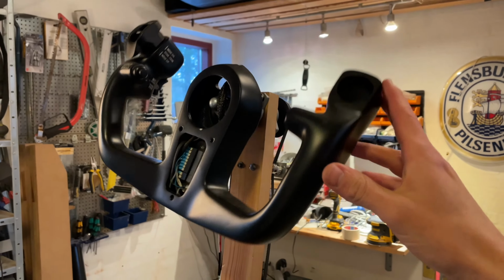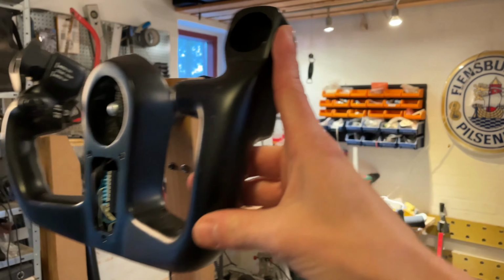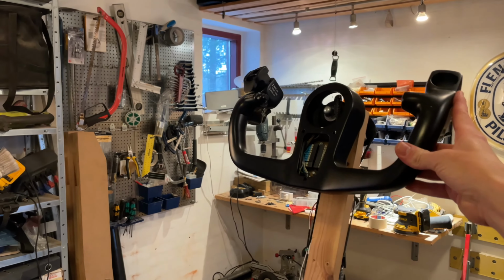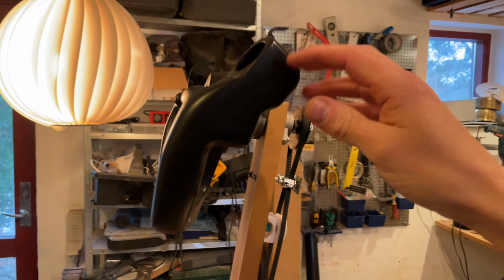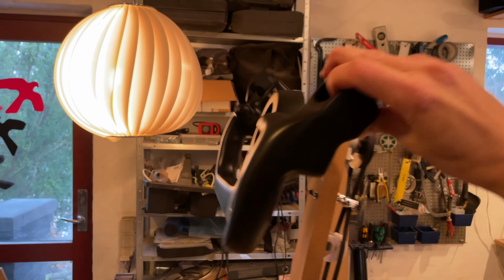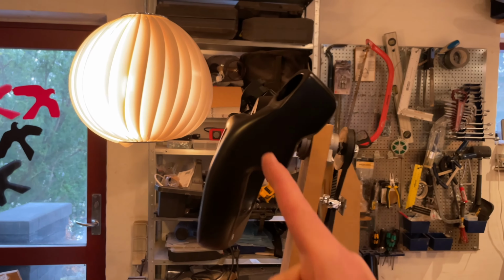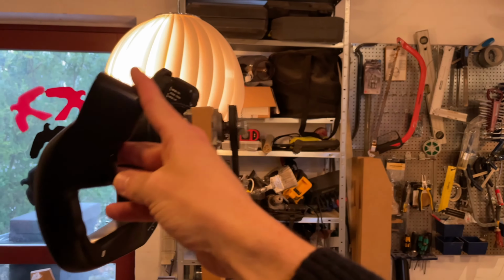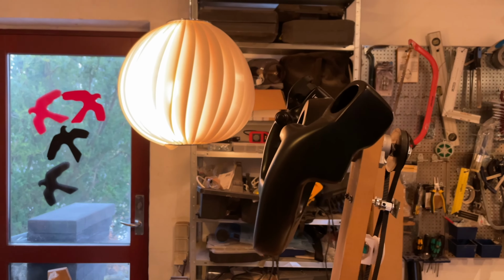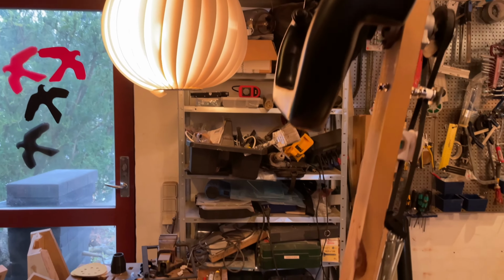So that was the aileron. The other thing is the elevator. This one going back and forth and having it coming back to the same position. If you look at from the side here, you see if I pull it forward, it goes back to the same 8 degrees. It has to be 8 degrees, and if I pull it back, it comes back to the same position. That took a lot of time, and of course it's mounted here on a stick, and all the